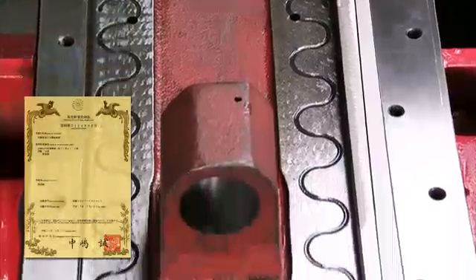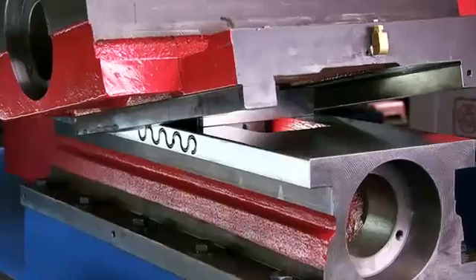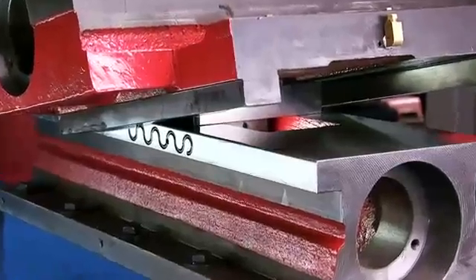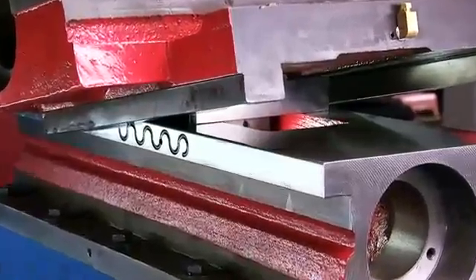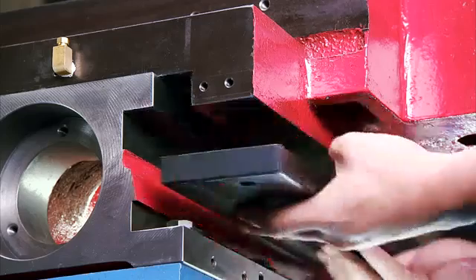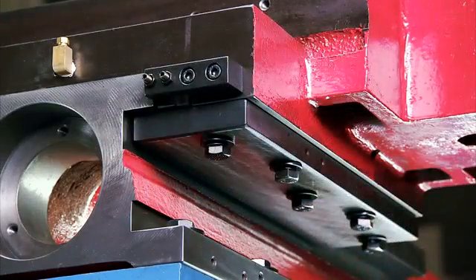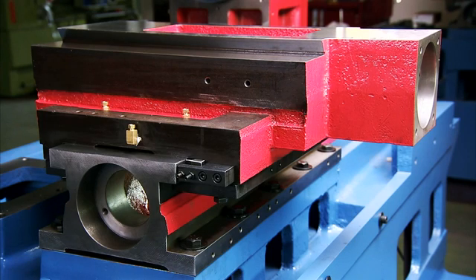This special slide seat adjusting system allows for very easy micro adjustments to be carried out to recalibrate parallelism of the sliding faces and eliminates wear and tear and the need for realignment or re-scraping. This combination delivers exceptionally long high precision surface life as well as simple low cost maintenance when the parts eventually are replaced.